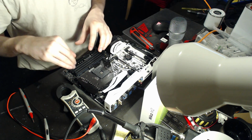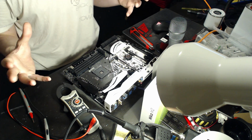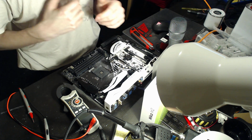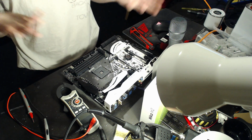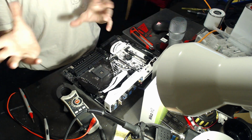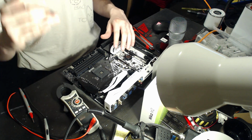But that's on the memory VRM, which generally isn't as important, so these huge voltage errors aren't a catastrophe there. Vcore VRMs are generally a lot more accurate, but I still don't trust them, because it's just better to know for sure that it isn't some weird sensor misreporting. It's better to know for sure that it is, in fact, the same thing.